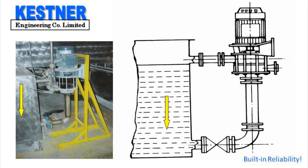The pump is then switched on and will deliver fluid to the designed pressure until the level in the tank is so low that air is sucked into the pump suction line, at which point the pump will stop delivering and will run dry until the level in the tank is restored. This process can be repeated indefinitely.